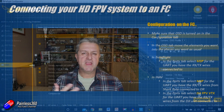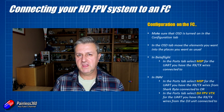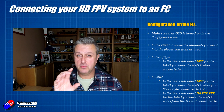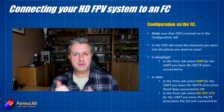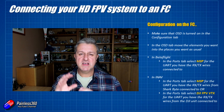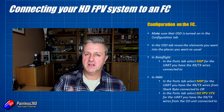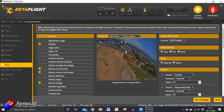There is a slightly more limited range of elements that both of these systems support — they don't support the full range that you get on analog FPV at the moment. Make sure that you're always keeping up to date with the latest manuals and notes online for these two systems, as further updates come out and extra functionality may be added. Drag the pieces that you want into the positions on the screen — those positions on the OSD tab will also drive the positions of how they appear in the HD FPV image that you're going to get in your goggles.